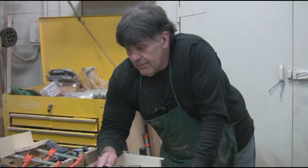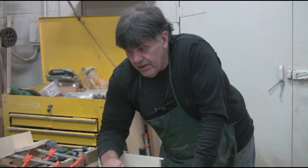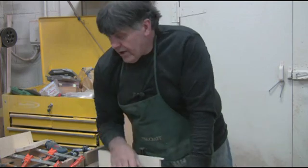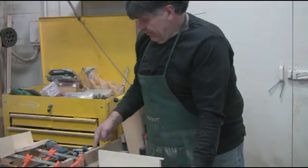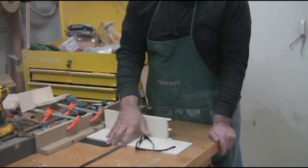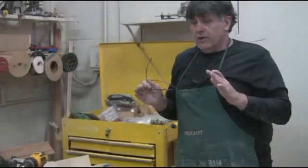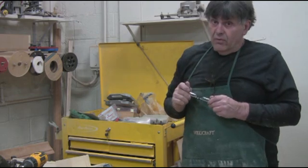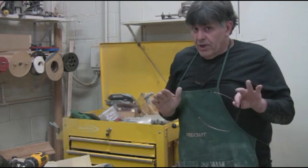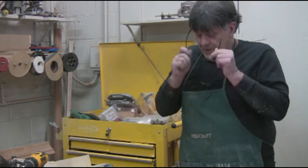And make your little router table that your router goes under. All I did on this one was take a 3/4 flush trim router bit, bring this fence over, set it up, and run it. Made me a track. Nothing fancy here. Having a little router table set up with a miter slide really works nice. Something you probably really want to think about, because when we get to doing our doors, we're going to really need it.